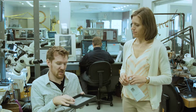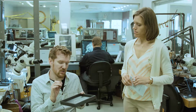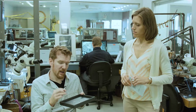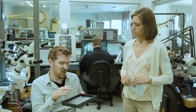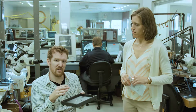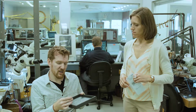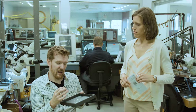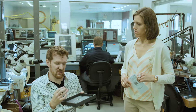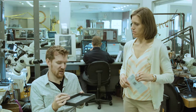Okay. Its alloy is slightly different than the alloy used in the bracelet, just to lower the melting point a little bit, so when we heat it up with the torch, the solder melts first and not your bracelet. We don't want your link melting, we don't want the links fusing together and creating a stiff point. So we are going to use this silver solder to act as the glue that is holding that link together, but it is still sterling silver.